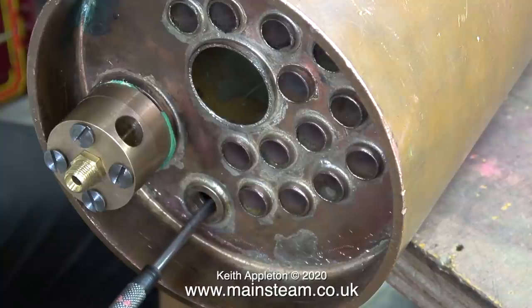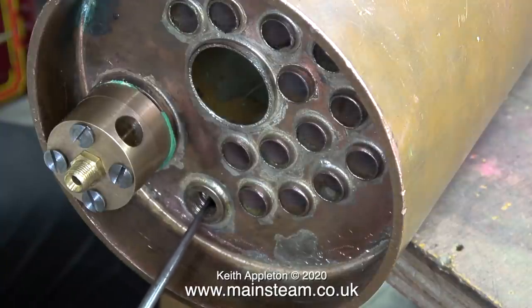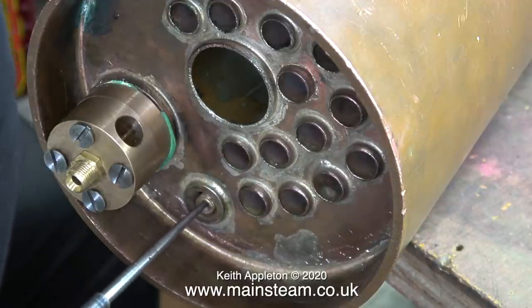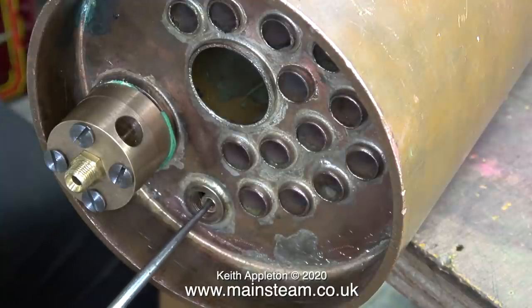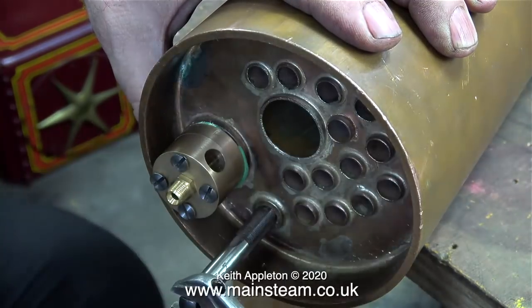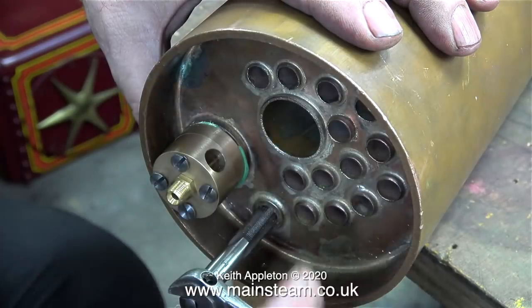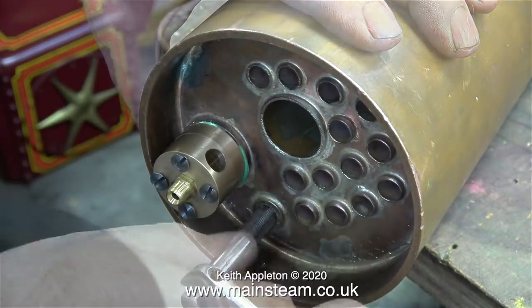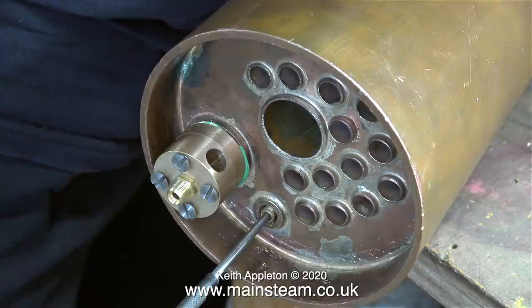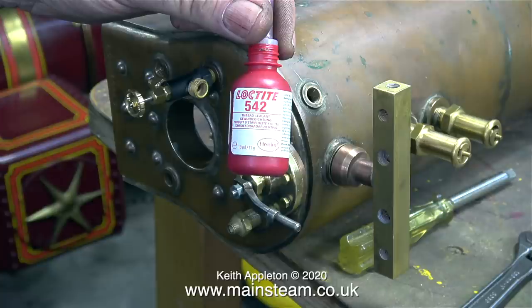Time for a top tip, because trying to do it that way causes insanity very quickly. Turn the boiler into such a position so the bush is at the bottom — then you stand a much better chance of catching the end of the pipe with the scriber to guide it through the hole. And before any viewers write in — yes, I am aware of the split gasket on the wet header and I will do something about this shortly. What I'm currently doing is using a 3/8 by 40 threads per inch tap to clean the bush because the thread wasn't very good in there. After repeating the process of finding the hollow stay with the scriber, the thread now engages perfectly in the smoke box tube plate bush.